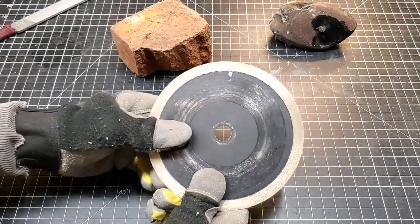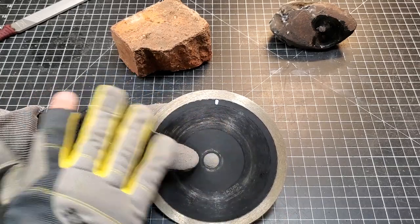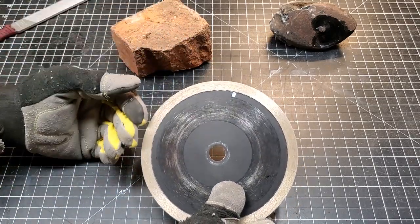What we're going to do now is go over to the microscope and look at this blade in its current state. I have a white mark here — I've specifically marked this blade with a paint pen so I can look at the same spot on the side and edge-on under the microscope. We'll come back, cut a brick, take it back up to the microscope, and see what we can see. Here at the microscope, you can see the embedded diamonds and the arrow showing the direction of travel of the blade — because with these blades, you could put them on so they spin either direction.